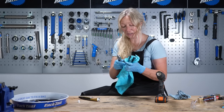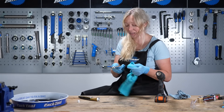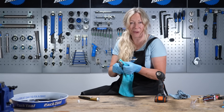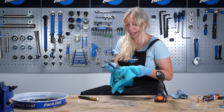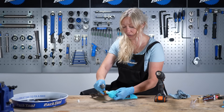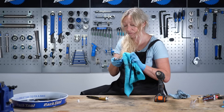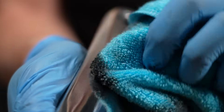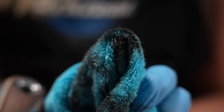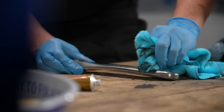That's about all I'll do with the drill. The more polishing you do, the shinier it gets, so just weigh up how long you want to spend on it. To finish, you have to do it by hand — get a little bit of polish on a cloth. I use a microfiber cloth because it doesn't leave fluff. Go over it by hand and you'll see the black start to come off. Keep applying and rubbing it back off until your cloth is clean.